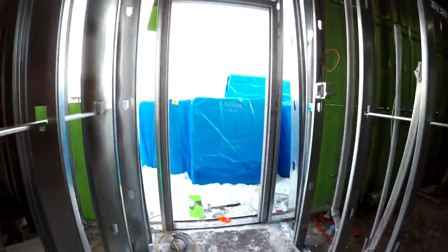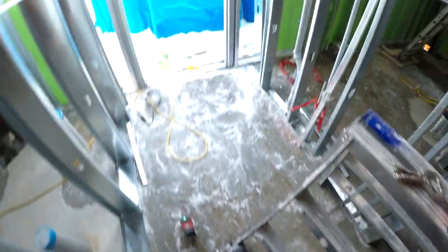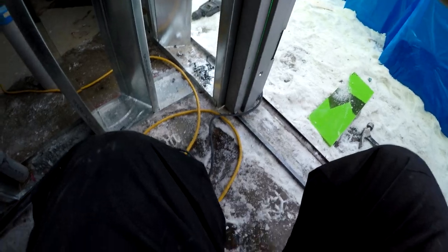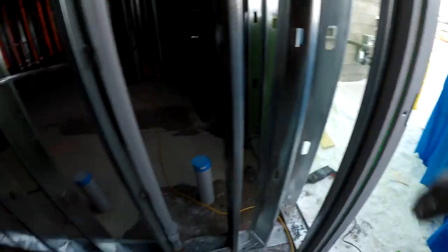I use a laser to level it. I like to point the laser right here on the inside of the jamb at the stopper. Something good here at the bottom — it's just splitting it — and you can see it's got to come in a little bit at the top. This is good. I can adjust it. I've got to go put screws in the stud.